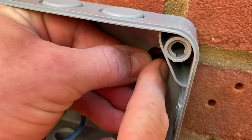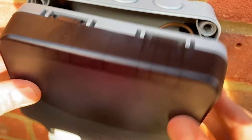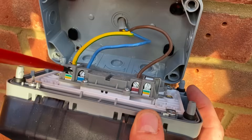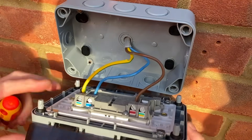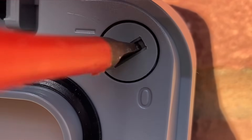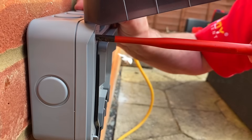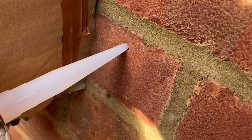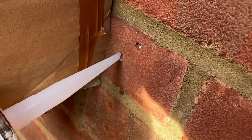All connections are in. I make sure they're nice and tight, then put the little caps on — they fit nicely into position. If you're struggling to get them on, you could use a little bit of sealant on the back to hold them in position, but they just pop in. Once all caps are in, I push the socket back, then pull it forward again to recheck the terminations are tight — moving them around can loosen them so just give them a nip. Once happy, push it back to the back box. Half a turn locks it into position on all corners, closing the gap on the edge and returning the IP rating.